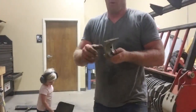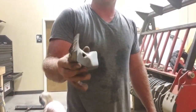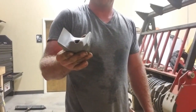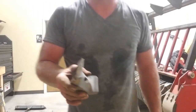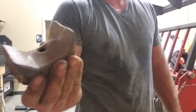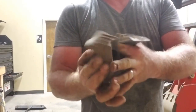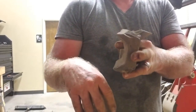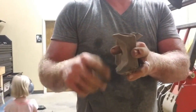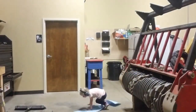People are going to ask this, but what kind of life do we get out of these? You know, we get anywhere from 100, 120 hours out of a set of teeth. I need to write it down more, but I stopped paying attention to it. There's a set that's completely shot. It might be able to get a little bit sharper out of it. If we get into a job where it's a bunch of rock, I'll go through and pick out a bunch of these and sharpen them up, put those on.